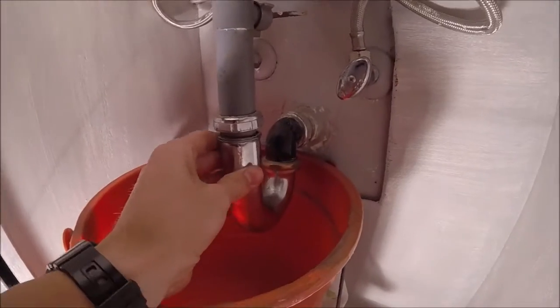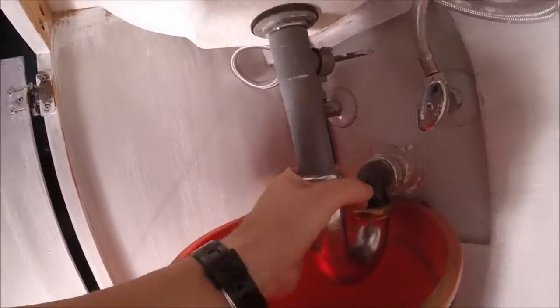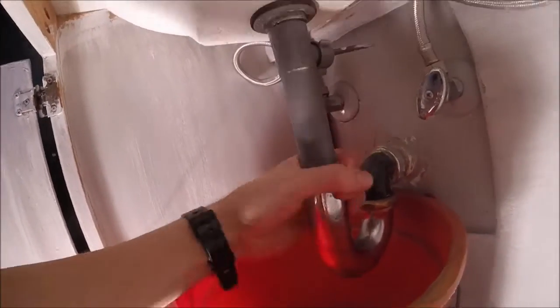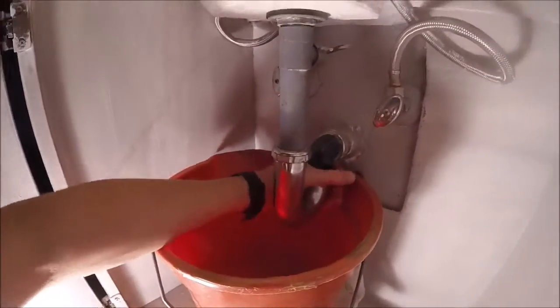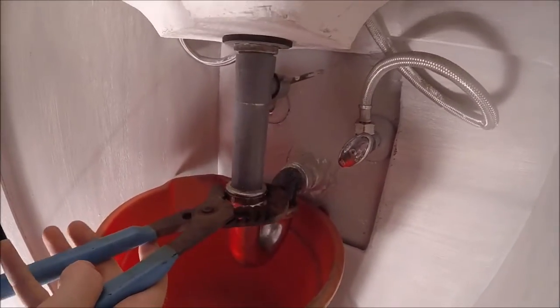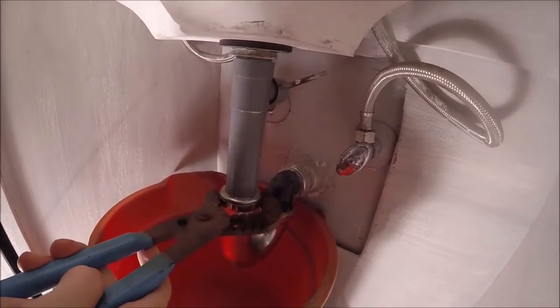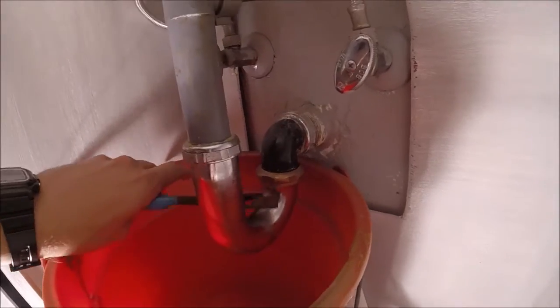Alright, now to reassemble. Take our P-trap, slip it back on. There we go. Tighten it down by hand, just turning it to the right. Now hand tighten this back one. There we go. Take our channel locks again. Give it a couple turns. There we go.